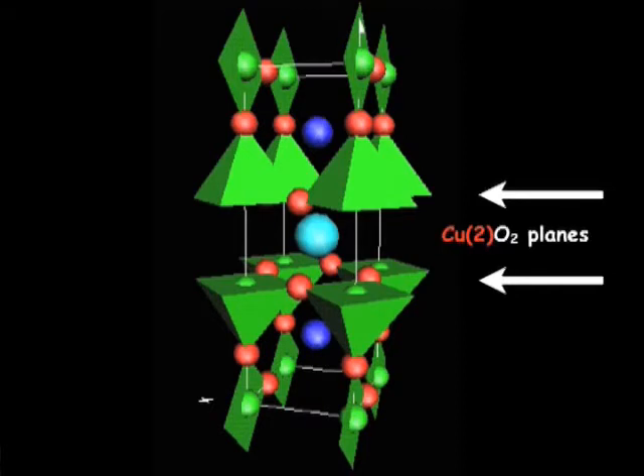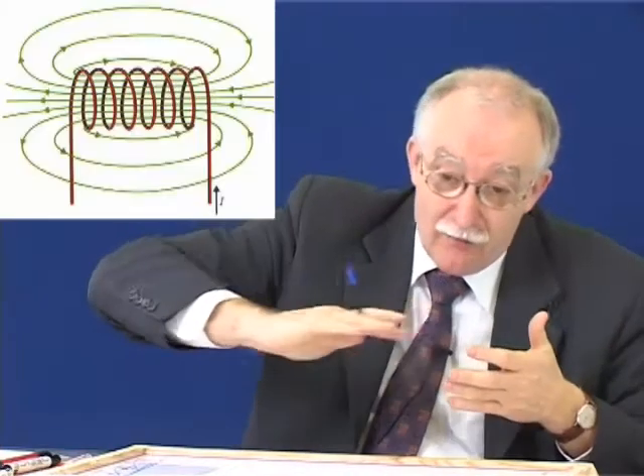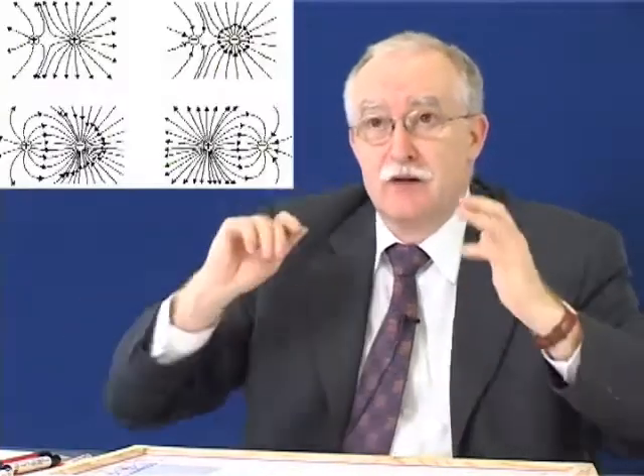Overall, the energy expenditure to produce large quantities of superconductors must go down. For that reason, we need to find chemistries which allow us to produce these perovskites at much lower temperatures. Finally, we would like to develop means of dynamic texturing — rather than relying on a textured substrate, we need some action to align these crystals while they grow, such as magnetic or dielectric systems.